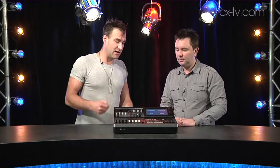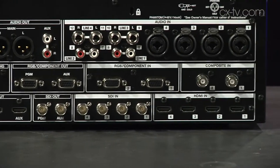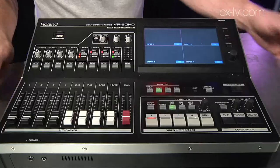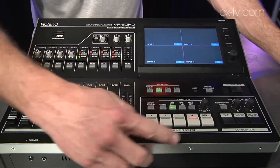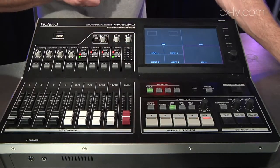Starting with the fact that it's a four-bus mixer. We've got a choice of HDMI or SDI for each of those inputs, plus also composite, component, or RGB for the first two. There's also a four-slot still store we can cut to. There's a built-in multi-viewer on the touchscreen here, and that also outputs on HDMI. Every input has scaling — we can zoom, reposition, and change the aspect on any of the video inputs.